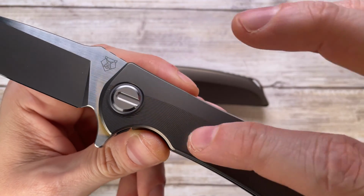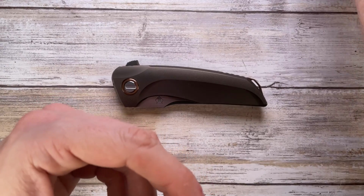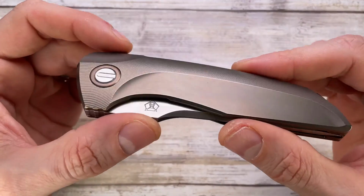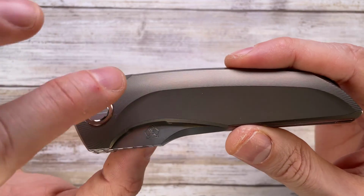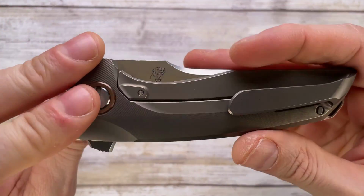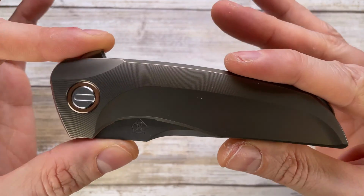Same thing goes for the Russian Overkill. Look at this, micro milling and flush and flat area. Same thing you can say for the RFT, Russian Flipping Tanto, just in the center right there. So, classic scheme for milled and not milled areas on the handle, nicely curved and radiused chamfers 1 and 2 over here, and of course symmetric on the lock side. It's just gorgeously done, guys.